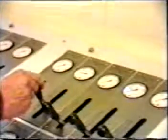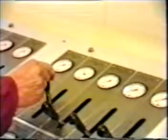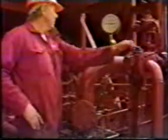2. Raise the cargo pump pressure to above shoreline pressure before opening the cargo valve. This to avoid backflow over pumping. 3. Also open the stripping valve between pump and discharge line. Keep the stripping valve open for approximately 5 minutes to get rid of the air pocket or gas pocket trapped in the stripping pipe. This to avoid pulsation, vibration in the cargo pump.